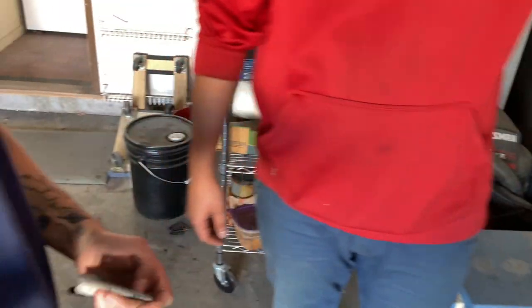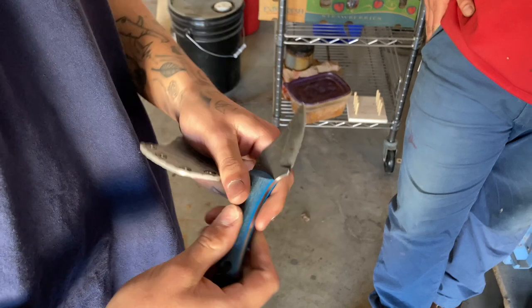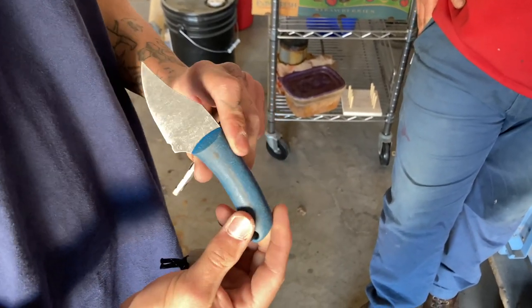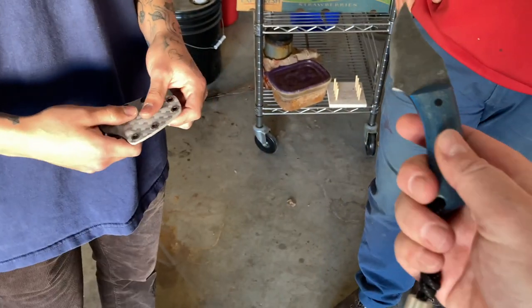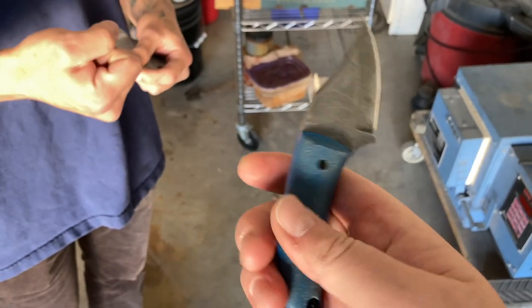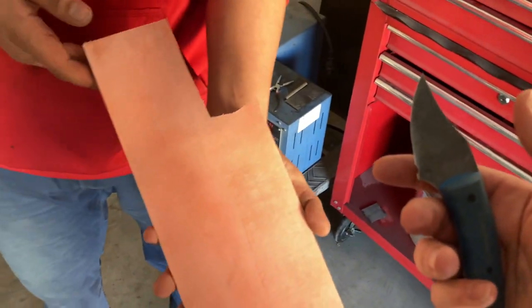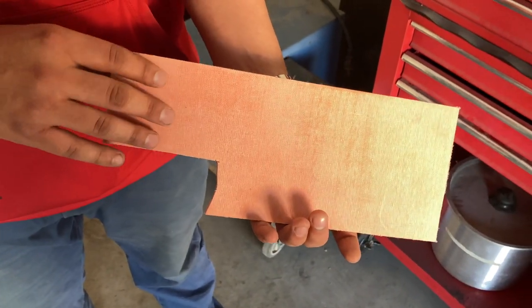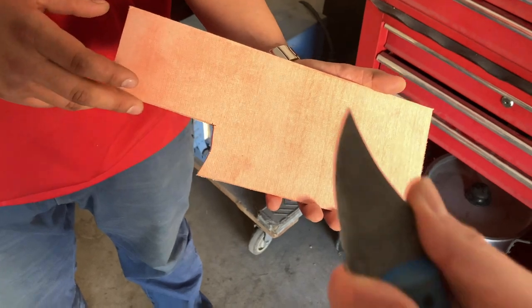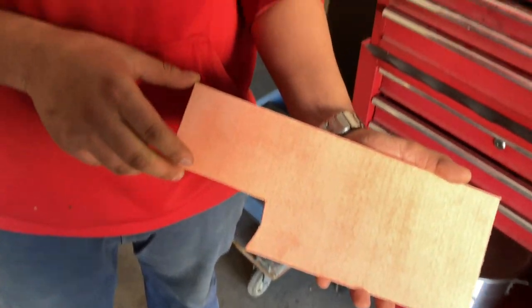So this is another one that you made? This is the Fat Boy — the first Fat Boy I made. It's chisel hollow, here's the flat, got satin spine and tang. TerraTuff with blue G10 liners. This is that TerraTuff you were telling me about — feels amazing. It's frayed almost like a towel, so when you squeeze it, it just gets grippier and grippier. It comes in a sheet, just like Micarta, but it's different — more flexible, seems more impact resistant. And when you grind it, it chunks off instead of getting that fine powder like Micarta or Richlight.